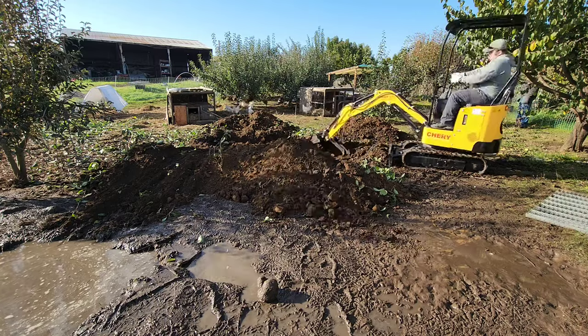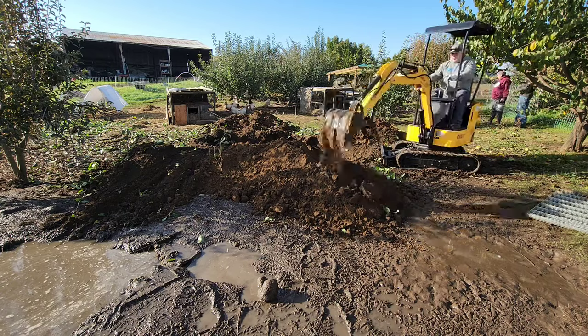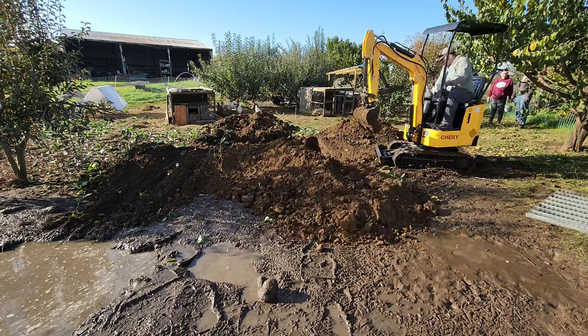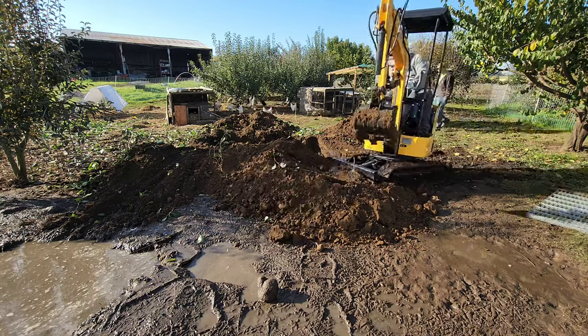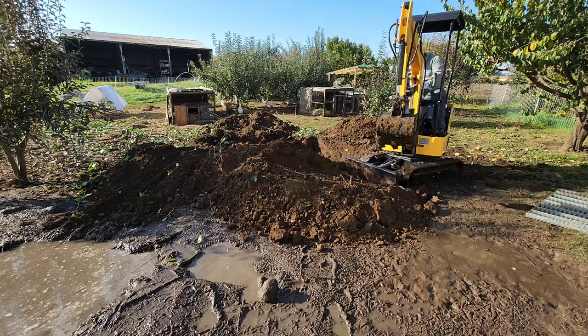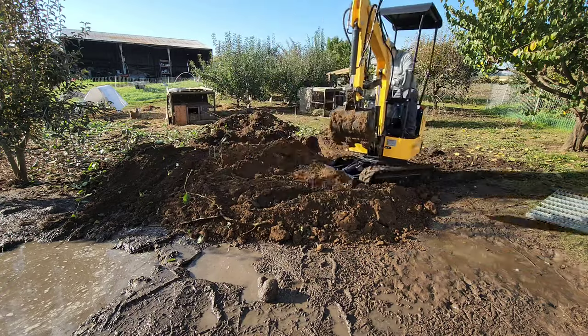Surprisingly, the biggest thing that goes wrong with these things that I'm reading on these forums online is the motor blows up, or seizes up is probably a better term for it. Now, why would a good Briggs & Stratton motor seize up? The most common cause that I'm seeing out there is that people are not changing the oil at the 5-hour mark.